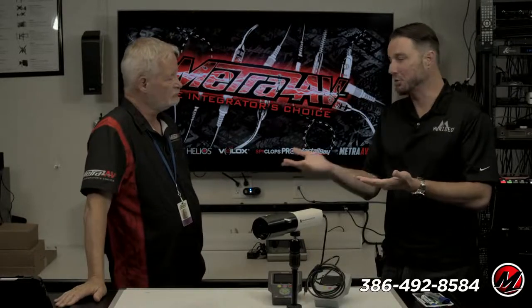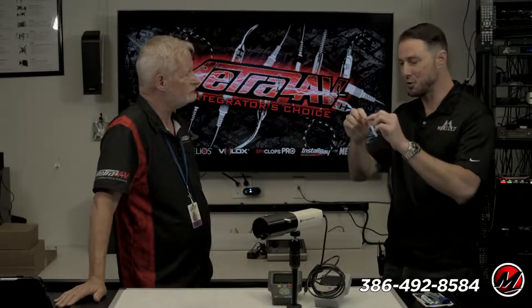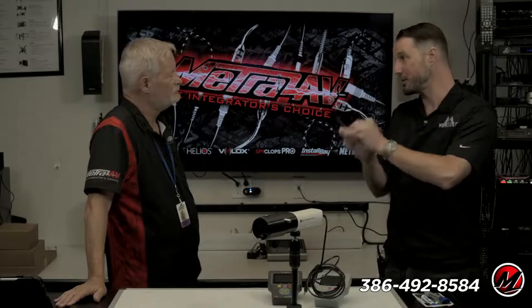And just in a nutshell, the way those TVs work, they still have a blue OLED layer. So that's what gets the electricity and lights things up. But there's a quantum dot layer on top of that. It's a super, super, super thin piece of film, and it's embedded with quantum dots. What's really cool about quantum dots, the size of the molecules determine what color they are. It's really cool, almost sci-fi type stuff. So when that blue OLED layer passes through the quantum dot layer, the blue is converted into red and green. So now the actual pixels that are lighting up and giving us a picture are red, green, and blue.